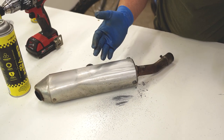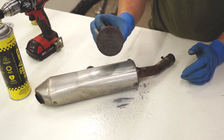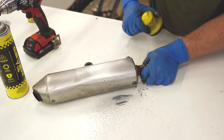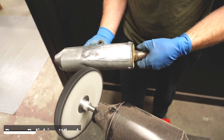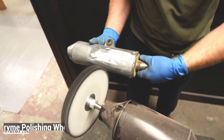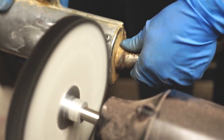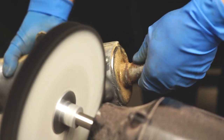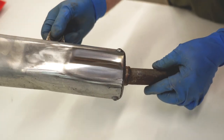Now there are a couple ways we can go from here. We could just leave it — it doesn't look half bad, just sanded with 180. Or we could touch it up with a cleaning-type pad to give it a brush look, kind of bring it back to a consistent shine. That doesn't look bad at all either. Now if you want a full mirror shine out of your part, you can use a number three polishing wheel along with a blue compound. That pulled a nice shine out of it, considering what it looked like before.